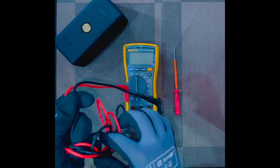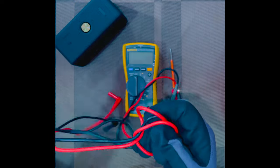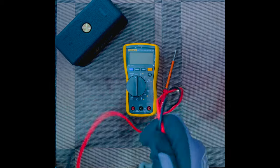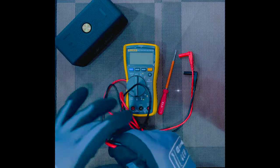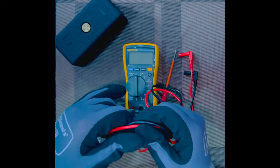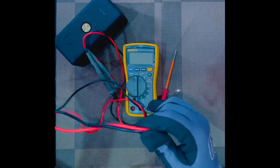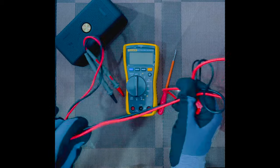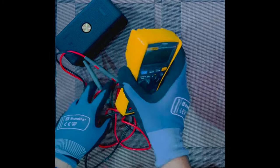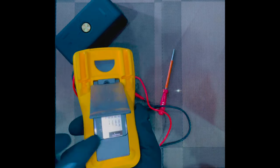Now always remember, whenever you wish to connect the probes, there are a few safety or physical checks or inspections which we need to do before you do the test. In the inspection part, always check the leads for any physical damage to the insulation. If there is any physical damage, check carefully. Our probes are brand new, so these are very good to use. Always confirm that the equipment is calibrated. By the equipment, I mean your multimeter is calibrated. The label is under the protection casing. See this right here, it is written calibration.